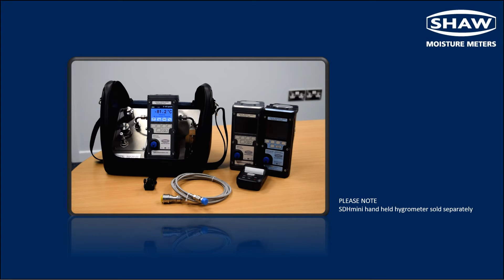The SDH portable sample system assembly is mounted on a stainless steel chassis which sits in an anti-static carrier case. Each unit features a flow indicator and inlet and outlet connections for the SDH Mini. The SDH Mini docks securely in the self-contained sample system and weighs less than six kilos with the instrument in situ. The compact size means a unit can be taken as close as possible to the sample tapping point.